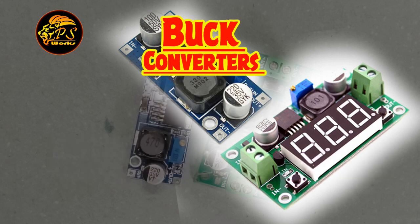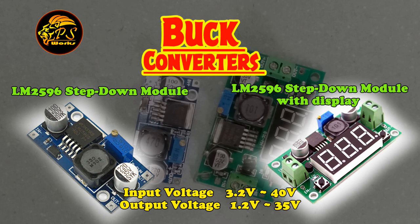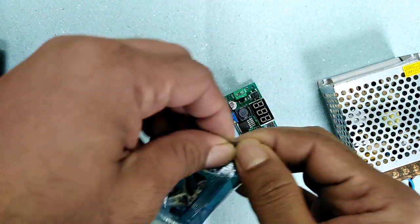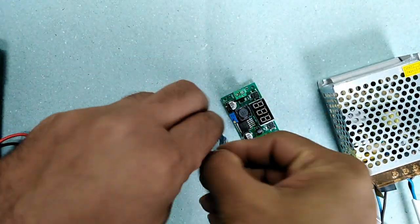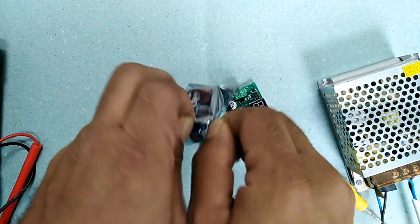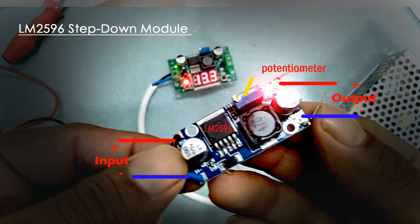So let's see how to use a buck converter. A buck converter is a converter that can step down an input voltage. We can set the output voltage to the desired amount by using this potentiometer. This is a switch mode power supply — the LM2596 DC-DC buck converter step down power module with high precision potentiometer, capable of driving a load up to 2A with high efficiency. When the output current keeps greater than 1.5A or output power greater than 10W, please add a heatsink on it.